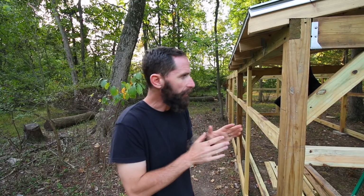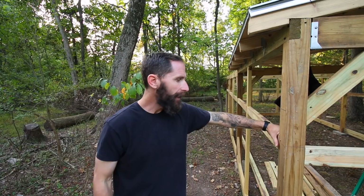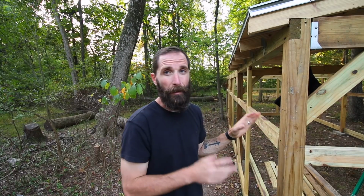What's wrong with you? All right, well, the one thing I've been wrestling with here is, do I staple it on the outside or do I staple it on the inside? And I went back and forth. I'm gonna do it on the outside. And the reason is because the predators are gonna push in. The birds aren't gonna push out. To put it on the inside would have just been cosmetic to make it look prettier on the outside. But I'm gonna put it on the outside because I've got way more surface area and I don't have to, you know, finagle the wire at all. I can just staple it right in and be done. That's what we're gonna do.